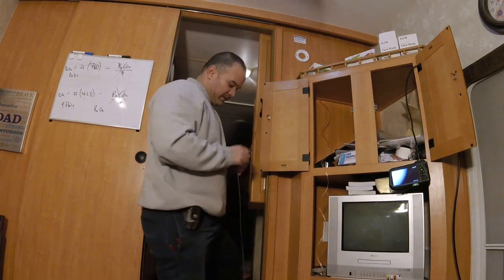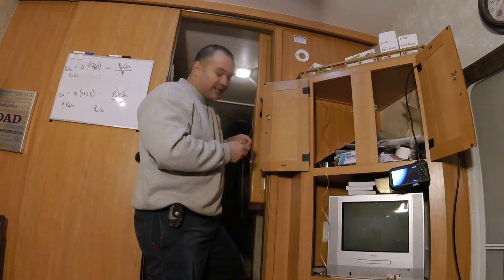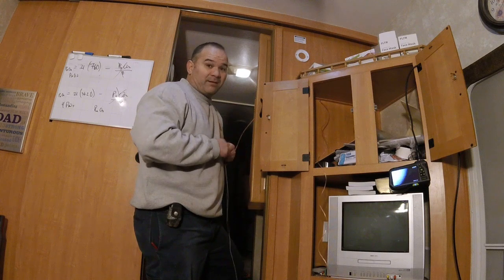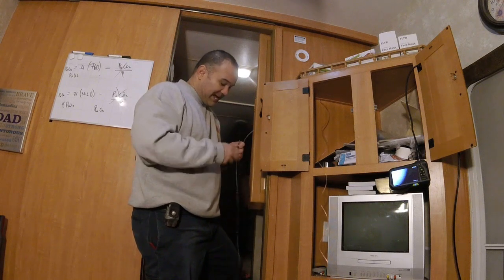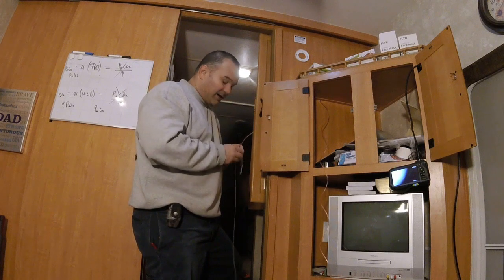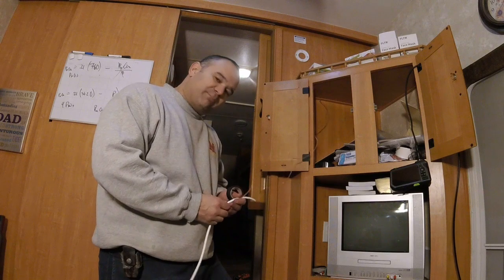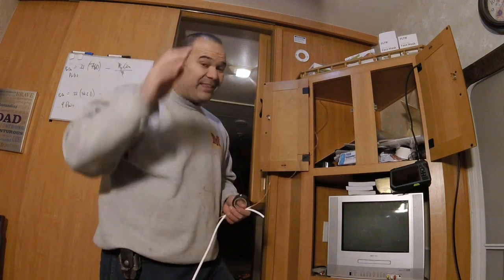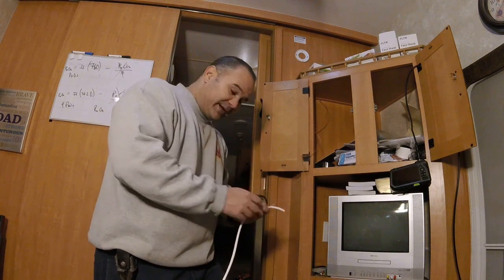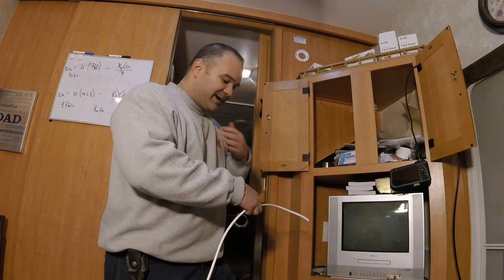There we go. All right, man, that's pretty much A to Z. Here's a little tip for you. Every time you disconnect a string, tie it to something so you don't accidentally pull it out, because that would be disastrous. That string right there was hard to pull in. I've got it tied off, but that would have really sucked. After all that work that we just did pulling in all these strings, I can't think of anything that would be worse than losing the wire from the string. So make sure you guys do a really good job tying this thing off.